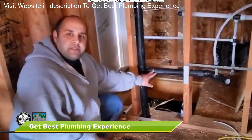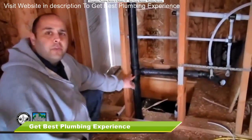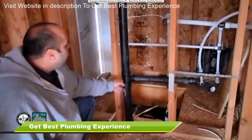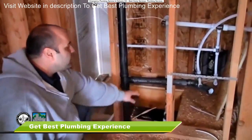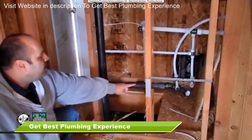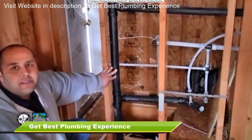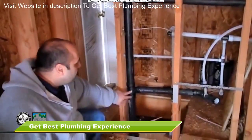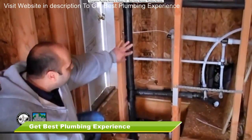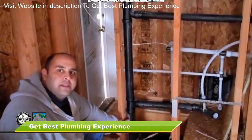This is called a wet vent situation. This is the time in which you can use it, it's called the vertical wet vent. What we've got here is the 2-inch vent from the water closet. We have the 1.5 inch line from the bathroom sink that ties in here. And then this pipe here is going to act as the vent and the drain for this system. So we're vent above here, we're wet vent down here. That means we're a vent and a drain in the same system.